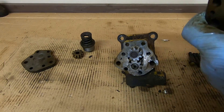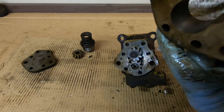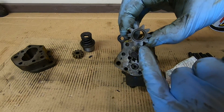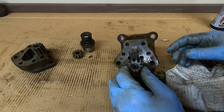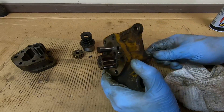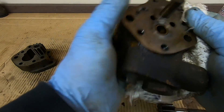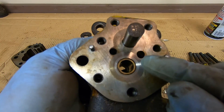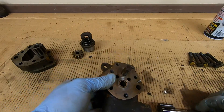You know, is that rust or will that wipe off too? It's looking kind of dirty in there. Actually it's coming off fairly clean — I'm starting to like what I see here. Idler gear — note the circular groove that's in the top of it; the bottom side is flat, so keep that in mind for reassembly orientation. We're still a little bit stiff on that pump shaft — it's just stuck in this other packing seal back here. Take a little look at this body; this is the difficult piece to recondition if it's ever worn badly. You can see witness marks.